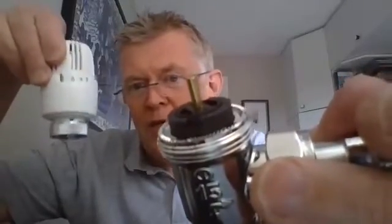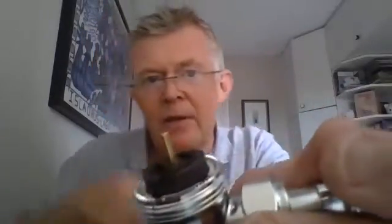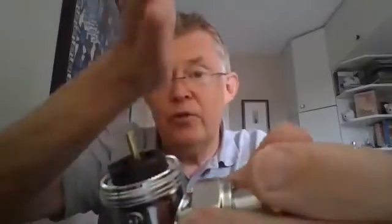So you're always going to be able to line it up exactly straight on the front and make it look good. Those we haven't got on the RT212. It's quite an expensive operation to put that in. But if it's important for you to make your TRVs look straight or point in an exact direction, this is a much better way of doing it. So that's really why you'd upgrade from the RT212 to the 414 to give it a better valve.